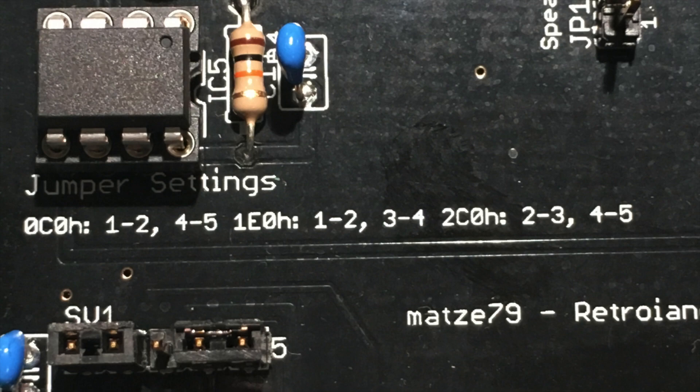On the top left you also see the little ATtiny 13 controller, which basically only mutes the sound output if necessary. On startup, you should put into your AUTOEXEC.BAT a little command-line tool which mutes all the channels, because on power-on they will just produce noise — and that's very annoying. So that's a little drawback of this card.